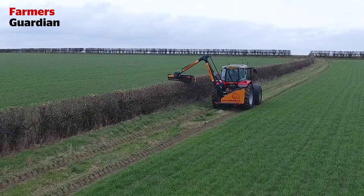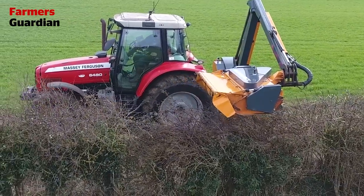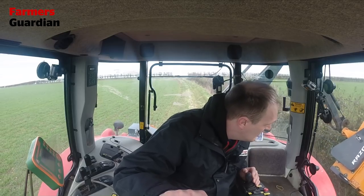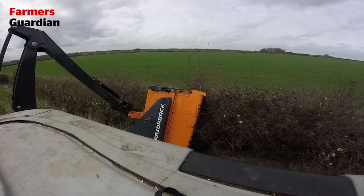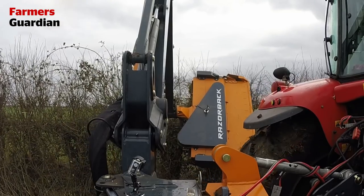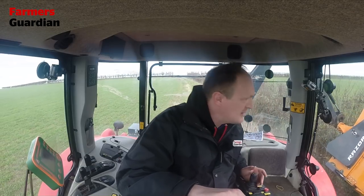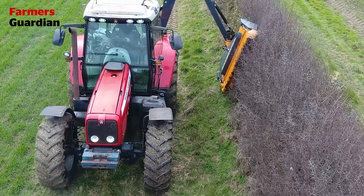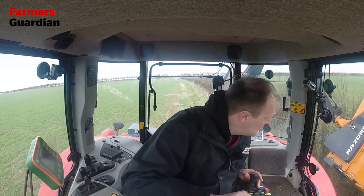Plus you've got no flails to replace — you've just got a big solid blade which should hopefully last quite a while, though that is yet to be found out. Overall then, hats off to Missouri for what they've created here. They've literally addressed two major issues with hedge cutters which, for some reason, haven't been addressed before. Number one is an auto-levelling system which really does just take a little bit of effort out of the job and can almost turn an average operator into a half-decent one. Second is this new head design — using horizontal rotors rather than a rotary flail — handles more material, less wear and tear, simpler, and there's more cutting area as well.